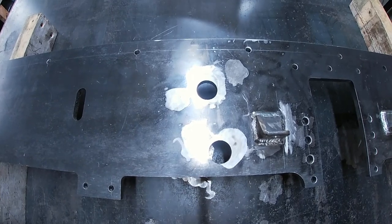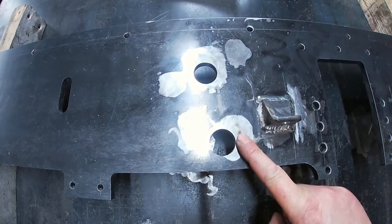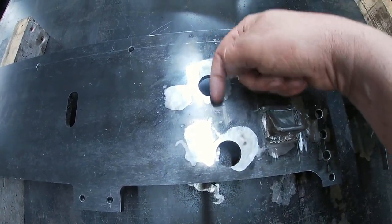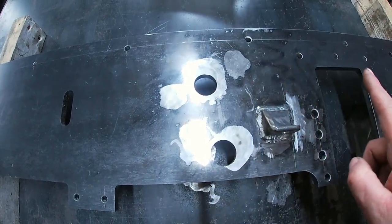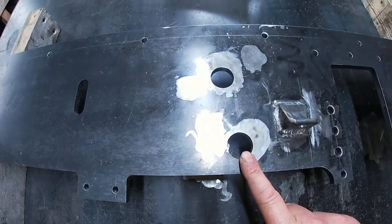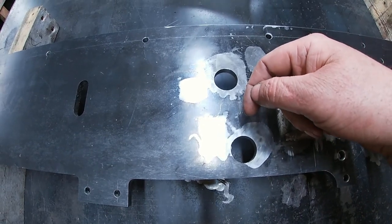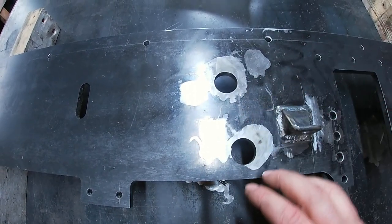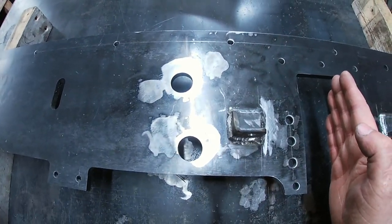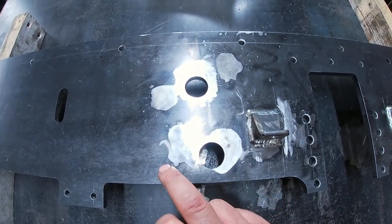There we go, that was a nice little trip out. We've got the holes done. Now we've moved not only the reverser lay shaft, that's been dropped down to where it should be in accordance to the centre of the axle, I've also moved the brake lay shaft. I've moved it further away from this bracket and also dropped it down a little bit. So with regards to where it is in reference to the center of the axle, these are now spot on. So all I've got to do now is drill the holes